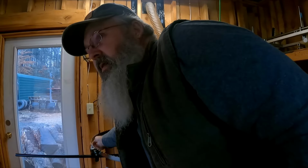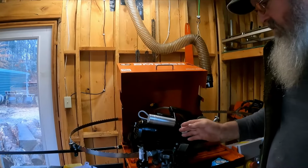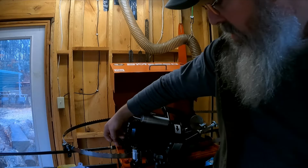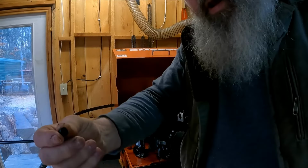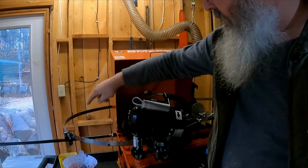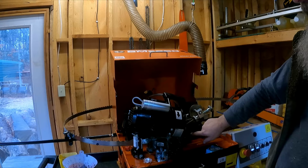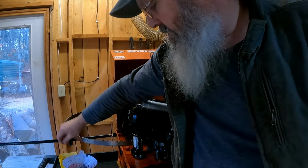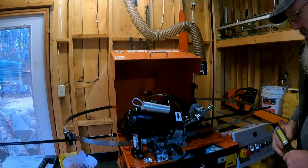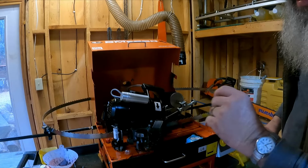The last thing I didn't show you, you got this little magnet. It normally takes 16 teeth. When you get it right where you want, he'll count 1 through 16. When it comes out the edge of your machine, take this little magnet and stick it on the other side at that point, and then go all the way around, and there's a little reader right here. When it senses that metal, it'll stop the machine. All I'm going to do now is take a visual look and make sure we don't have any short teeth.